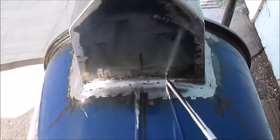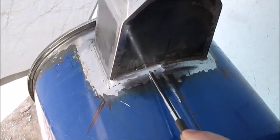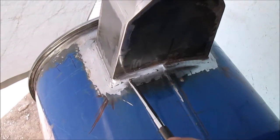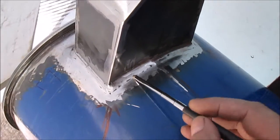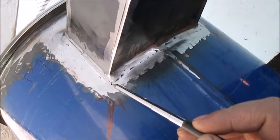Okay, we're done welding this on. It's kind of ugly on the bottom. We had a gap in there, not quite a 1/4 inch. We made a mistake on our template or whatever, or we cut outside the line instead of inside, so you do that two times. We have a couple spots marked where there's a few pinholes.